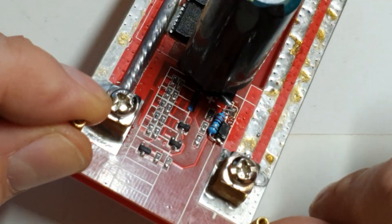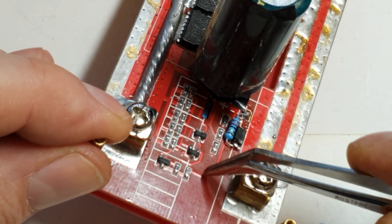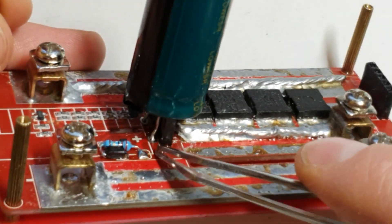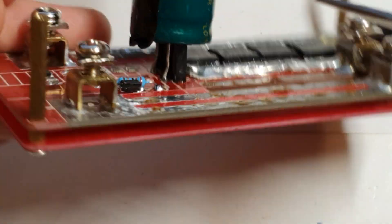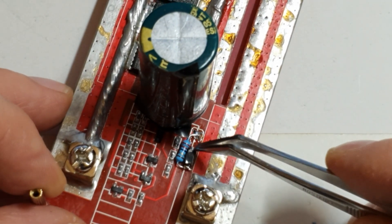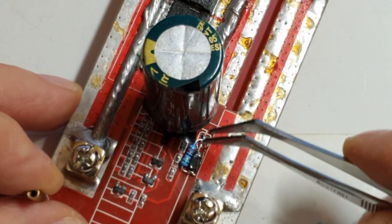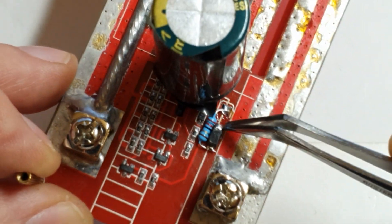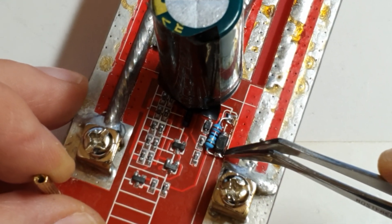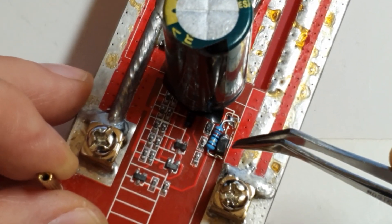As you can see, there is enough distance from the resistor to the other components. This is the BK11 — it doesn't have those two resistors post-modded. This is the mod: unsolder the diode, flip it around 180 degrees, keep this contact soldered where it is, you just pivot it around, then insert the resistor. One side is on the diode's free end and the other is on the pad — so the positive will go through here, through the resistor, and then to the cap. That will save your diode.